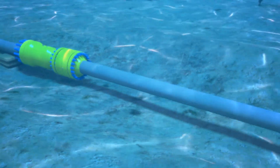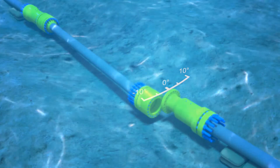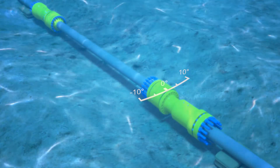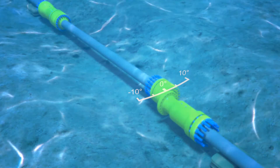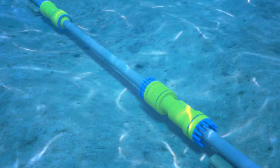Next, the right side of the spool piece will be adjusted into place for the second connection. The FlangeMate flange can be adjusted to up to 10 degrees per side for final makeup. The Griplock connector has an end gap adjustment of 6 inches or half the pipe's diameter, whichever is greater. This helps for final adjustment on the pipe end.